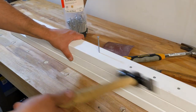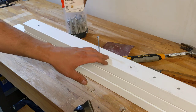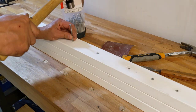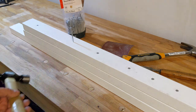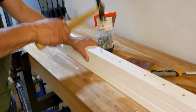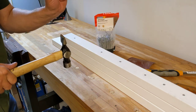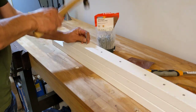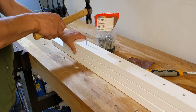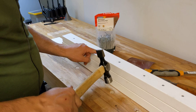If you're completely new to this, you'll also get a bit of knowledge from the timber itself. This timber is painted so I can't see too much, but I can see there's a knot there — you want to avoid those, that timber is going to be super hard. Don't force yourself. When it goes in you'll sometimes feel how the grain will grab the nail a bit and it'll move, but you compensate for that. That was a nice one — kind of creamy.